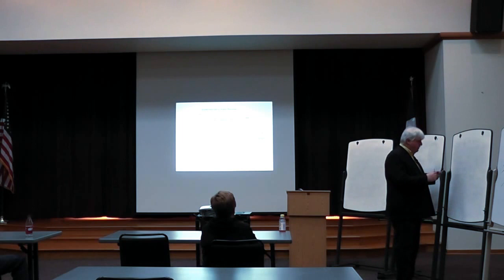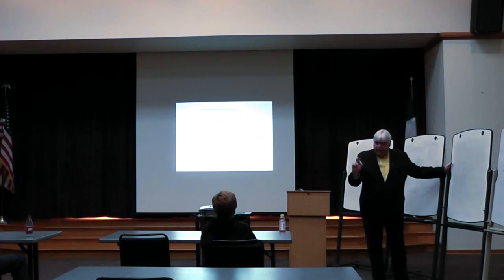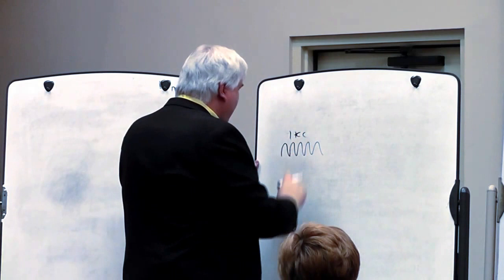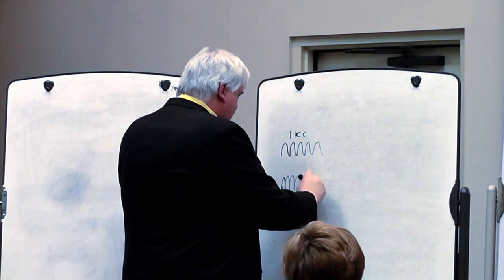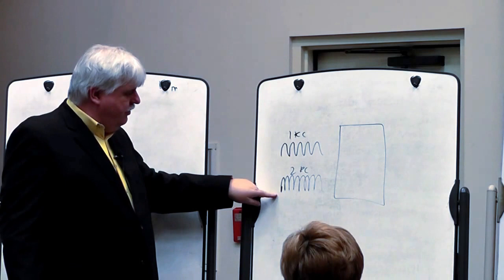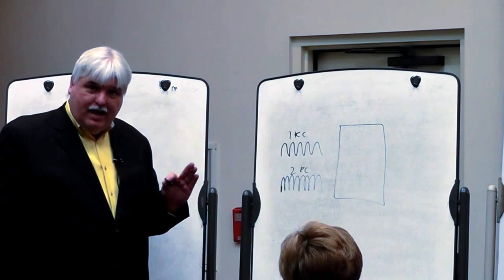If I combine radio signals, it's called heterodyning. Let's say I have a signal here that's at 1 kc, 1,000 cycles, and I have another signal here that's a higher frequency at 2 kc. And I feed that into a heterodyning system. Okay, I have 1,000 coming in and 2,000 coming in. When I combine those two in a heterodyning system, the output of that is the two fundamentals.